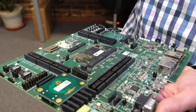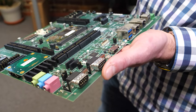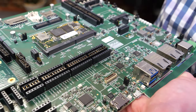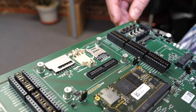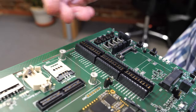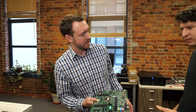We also have CAN, RS-485 or RS-232, provided over the UARTs of the connector. We have native HDMI, MIPI DSI, USB On-The-Go, and a variety of other interfaces. There are also module-specific interfaces where we've dedicated some pins for things not universally supported across all products — those are accessible via the connector on the development board. That's about everything we've done here with Verdin.